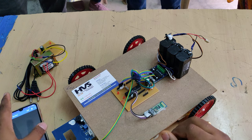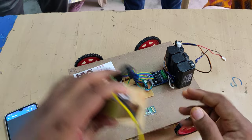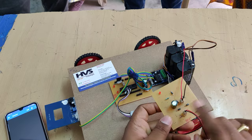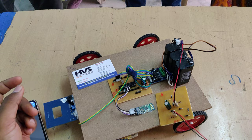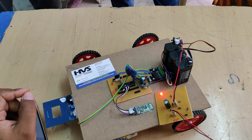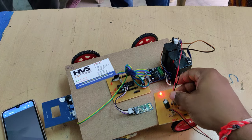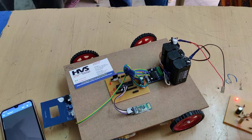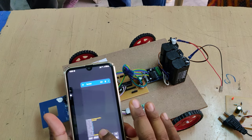Before the demonstration, keep the battery fully charged. Connect the battery at the B slots and the transformer at the T slots, then turn on the power supply with 230V AC input. An LED indication will confirm charging. The battery takes a minimum of six hours and maximum of eight hours to fully charge. Keep it charging for that duration before disconnecting.